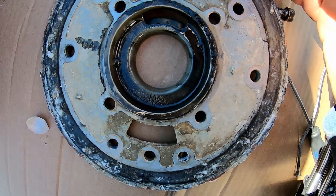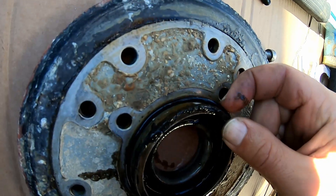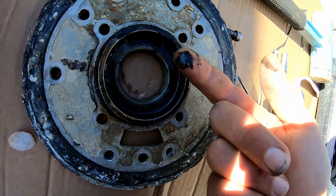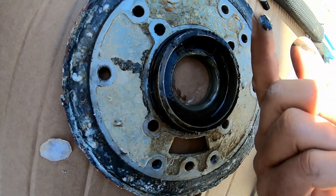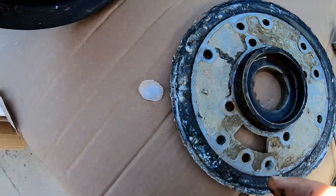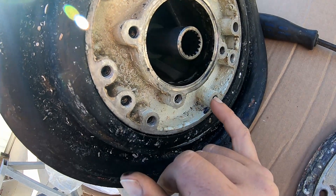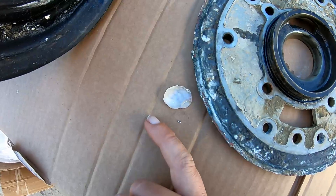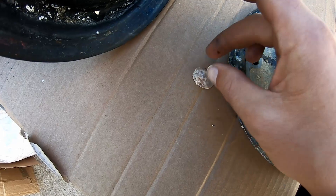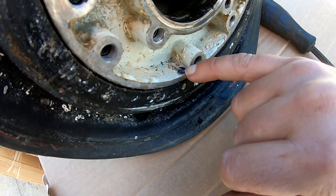The adapter plate has come off and there's a little O-ring here which will need replacing. But there's a lot of scum in the oil which has settled, so that's going to get a good clean out. All of this region here is exposed to the salt water chamber, and there's been some growth in there. There's actually a mussel that was growing inside - it definitely wouldn't fit through the pickup holes.